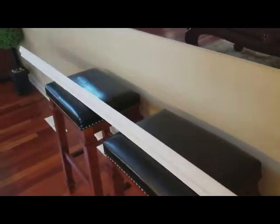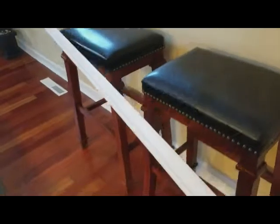I'm using a chair rail from Home Depot — it's solid wood. You're going to want to go through the stack and find yourself the best-looking pieces because you don't want one that's all dented up. It's probably about two and a half to three inches wide, which I think is perfect for the length and width of this mirror. Another tip when picking out wood you want to use ornamentally: you want it to be square, meaning no bends or bulges in it.